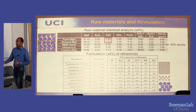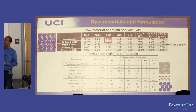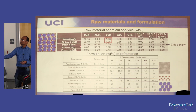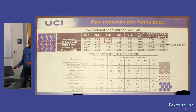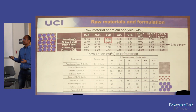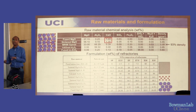Medium-sized spinel and periclase particles (red) and large 3–1 mm particles (blue) form a complex multi-size-particle brick. Each phase is very dense: spinel is 93% dense, others are 95, 97, and 99.5%. Using different particle sizes gives very high packing density, achieving 80% density before pressing.